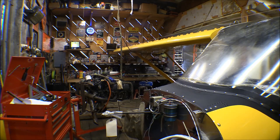A lot of the time in this airplane is spent flying slow, so the inboard section of the wing is going to be close to a stall. You still have plenty of air flowing over the outboard section and aileron, so you have control there. The inboard section has flaps — putting the flaps down lowers the stall speed further. The last thing you want is the outboard section stalling first, losing control of the airplane, and going into a spin.